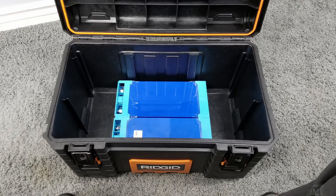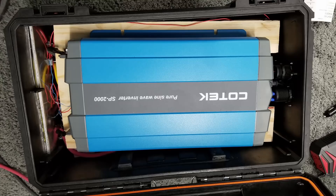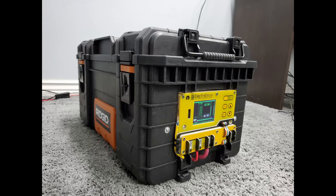I made the Ultimate Junior with three levels. The battery is on the bottom. The middle section is for most of the wiring. The top level is for the inverter. I used plywood separators between levels. The SBMS is on one end with a heat sink. The other end has all the connections. I wanted to keep it clean and simple without too much stuff on the outside.